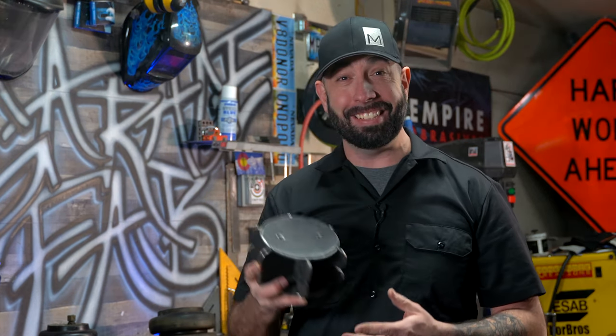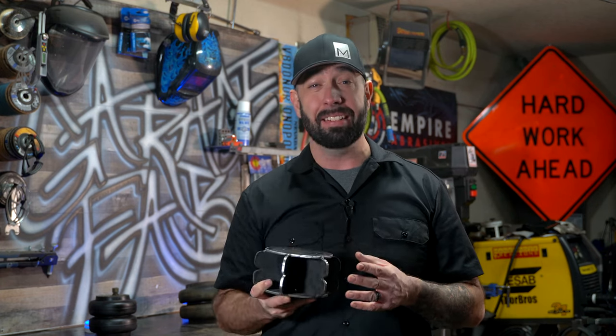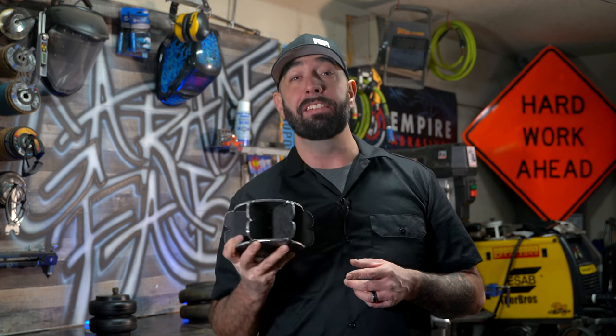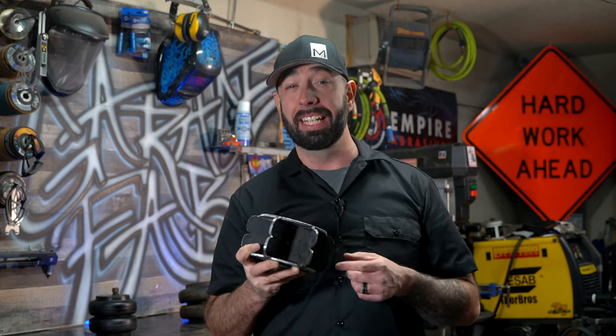Have you got one of these yet? If not, go check out the last video and make you one, or cut a wood block to the size of your bag's deflated height. It's important that you have something similar because the upper mounting plate needs to be mounted so that it's parallel to the bottom plate, directly above the bottom plate, and spaced away from the bottom plate at least the thickness of your deflated bag, preferably a touch more.